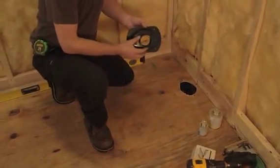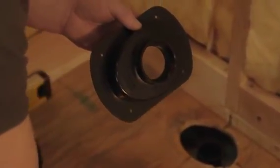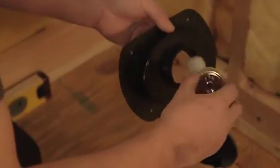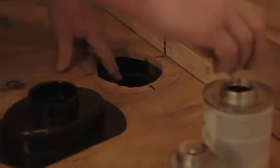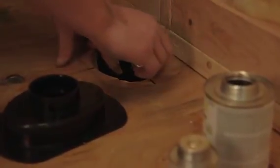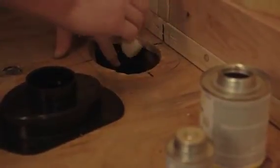It's important that the subfloor, whether concrete or wood, is even, clean, load-bearing, and free of deflection exceeding industry standards. Please note the 2x4 blocks added in between the studs. This will help back the connection between the WEDI Rialito base and the WEDI wall building panel, especially if some studs are not 100% aligned with your squared framing.